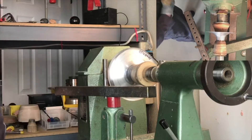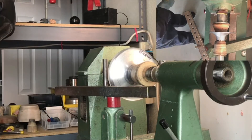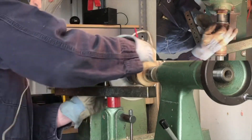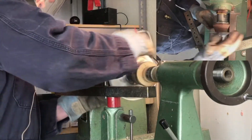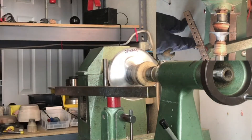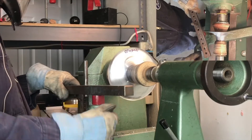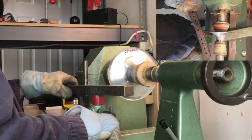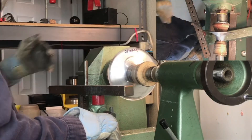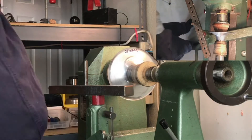While I still have access, this is a good time to clean that lubricant off of the piece, or even polish it depending on the design. What I do need to do, since I'm going to be spinning on the other side of the metal, is lubricate the other side. Resist the temptation to do this while it's spinning — that's an unnecessary risk you don't have to take. Regardless of the direction you're moving the metal, you want to make sure you're keeping the outer edge perpendicular to the axis of rotation to support the metal and keep it from wrinkling.